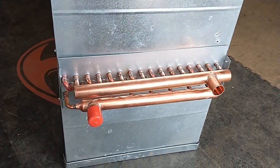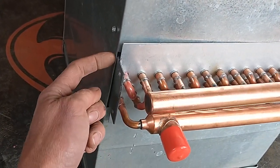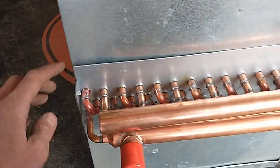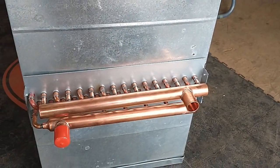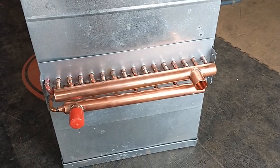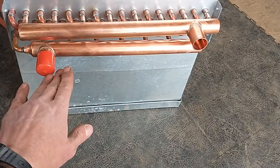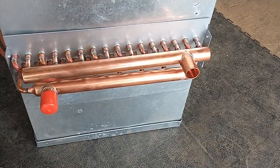To secure it, screw a rail or two in and put a screw or two in the side — just make sure you don't hit a tube; stay up on the edge and stitch it across the front. Some brands have the lip bent forward, so you'd bend your sheet metal out and stitch it across the top with a few screws and tape it. Also, if the fan is blowing up, try to space the coil a few inches off the fan so it spreads air through the whole coil and you'll get hotter air output.